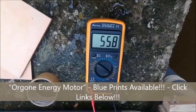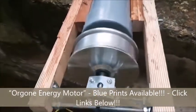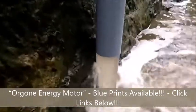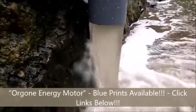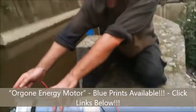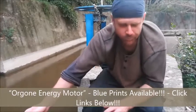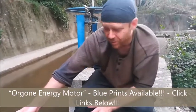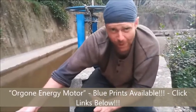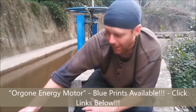There we go. That's the number. So, if we can get 10 amps off this hoverboard wheel, which it should be rated to, times 55 volts, if there's enough power in the full system, that means we could, without melting or damaging anything, get about 500 watts off the system quite easily.